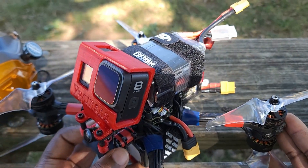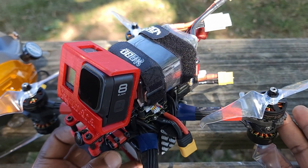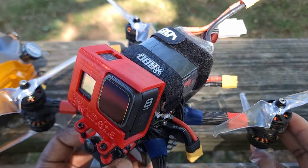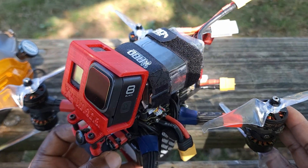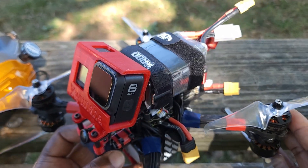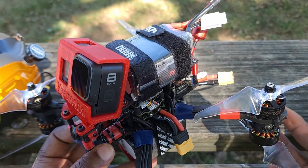As far as flight goes, it flies just like any other drone — it does not fly better or worse than a regular drone. If you're building one thinking you'll get it to fly better, it's going to perform just like any other drone. It depends on how well you tune it and on the electronics you use. If you use cheap motors, it's not gonna fly as good. If your tune is not good, it's not gonna fly as good. All the principles that apply to regular drones to get them flying well also apply to the X8.